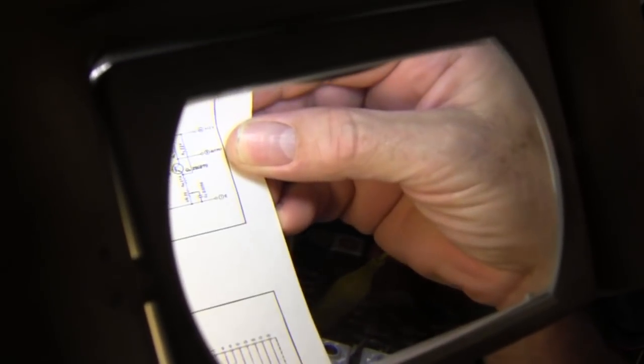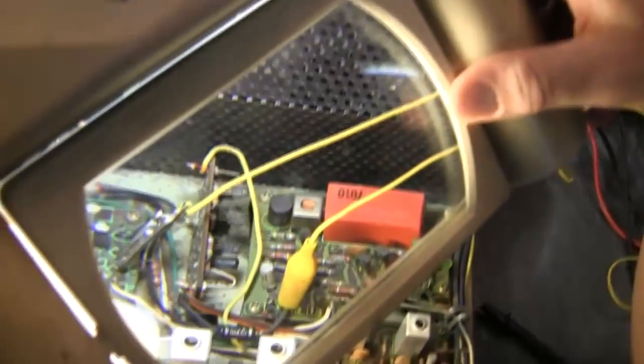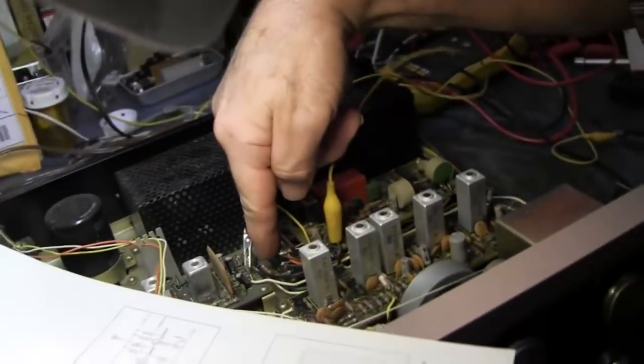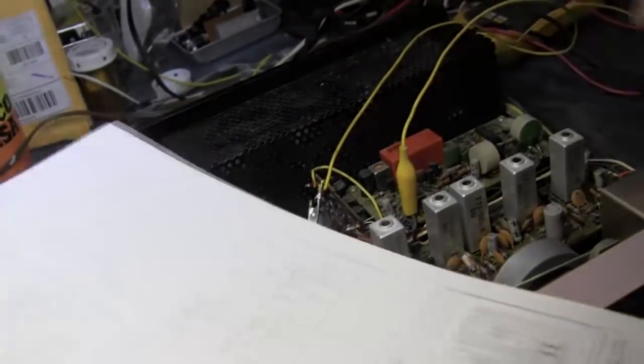Of course, we could take the oscilloscope and go stage to stage. Well, we could, and we may have to here in a minute. And pin 2 on the little board is the one where the coil, that's a resistor actually, between the IF and the muting board. So there's a coupling cap on this little muting board, could be our culprit, because it's right there, input.